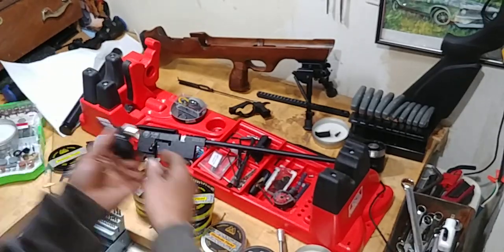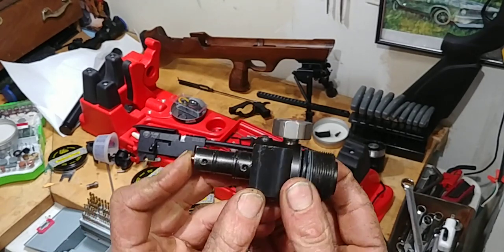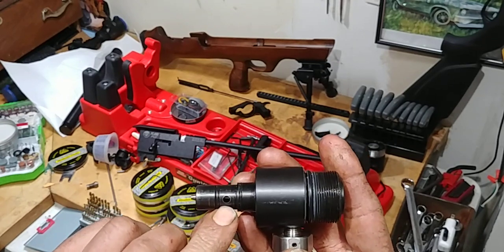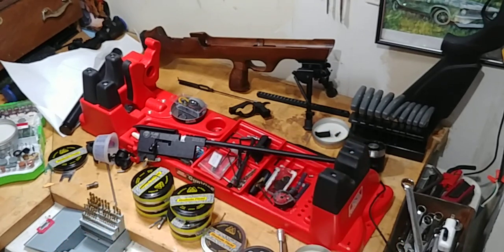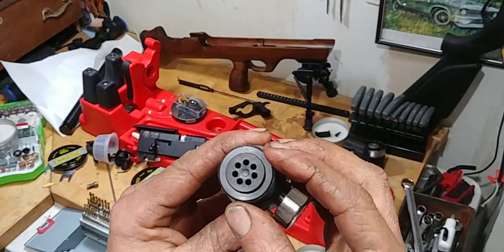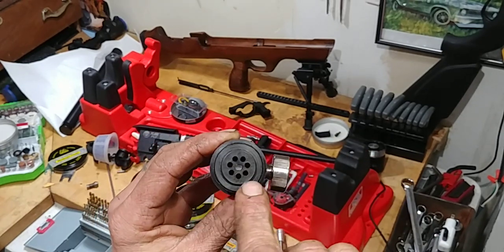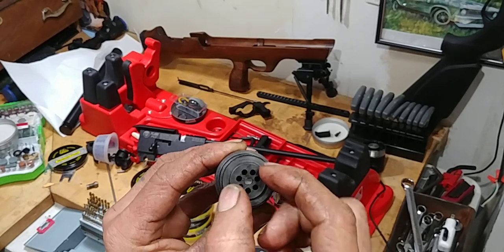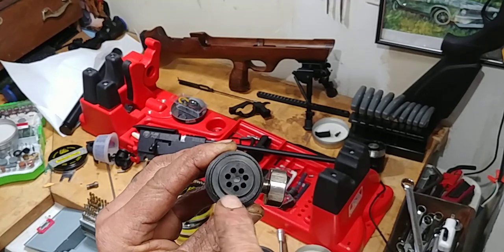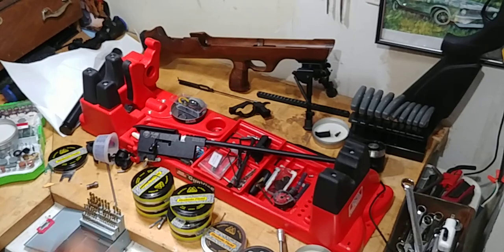Okay, tube is out. Here's your valve for the tube. Going to need to remove the needle so I can drill through and open this up. The best way I found, this is screwed on, very tight also. It is plastic. If you put a regulator on here, the O-ring seat sits right around here. You do not want to grab it with channel locks or anything and damage that, because you will have an issue with sealing if you ever do put a regulator in there. So don't do that, and I'll show you an easier way.